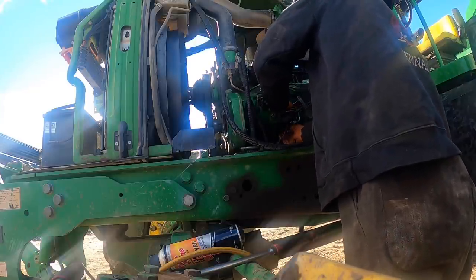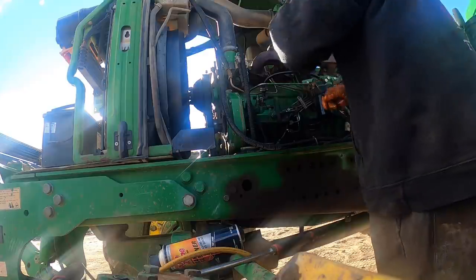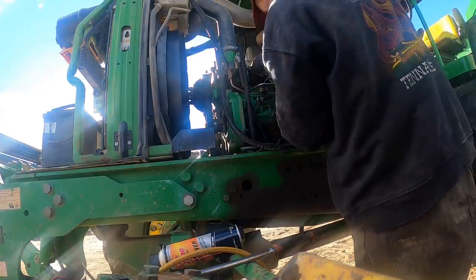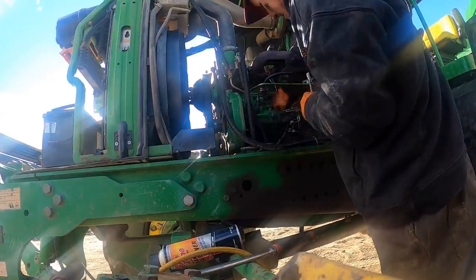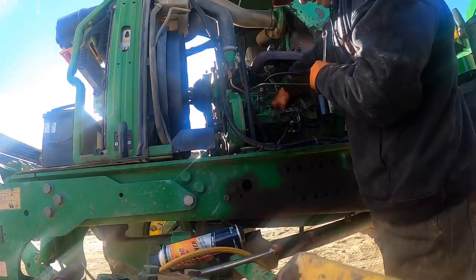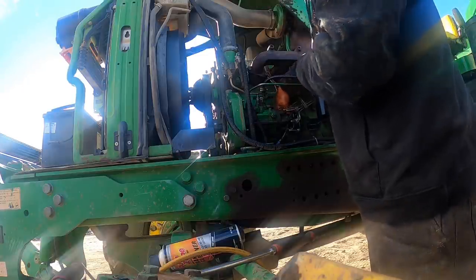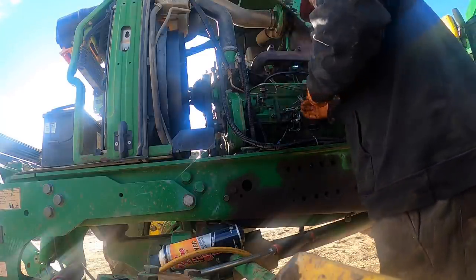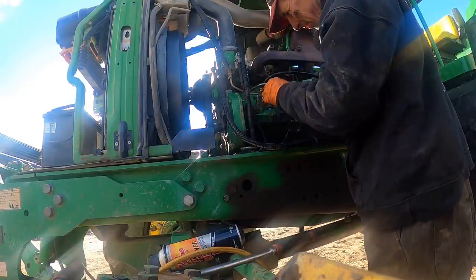But anyway, I went down there this morning to get the serial number off so I could give them a call, and I noticed oil underneath that Challenger. I had to pour like 30, 35 gallons of oil in that thing, and now I found out why. It's got a big suction manifold from the hydraulic oil tank that runs almost the length of the tractor, and basically all the pumps take a suction off that suction pipe. They tee into it and stuff like that. So the hoses are probably old and hard, and when it gets cold like this, everything shrinks up on you.